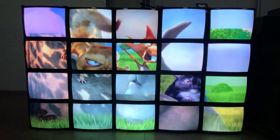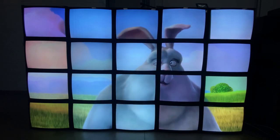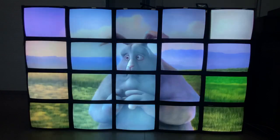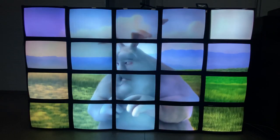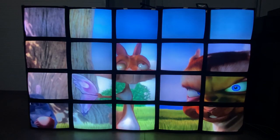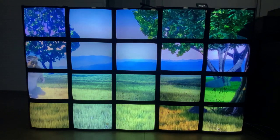Those two screens in particular are really standing out to me, which is slightly annoying, but there you go. We set this up just to test the screens were okay before they went out on a job — we didn't do any proper setup on them. Back in the day you would have taken a standard definition video signal and divided that across the five-by-four screens, so each screen was doing very low resolution. What I'm doing here is taking a 4K video and splitting it up across those screens, so each screen is actually still running at its full capability of 720 by 576 pixels. You're kind of watching nearly a 4K video on old analog standard-definition screens, which is something you can do now that you couldn't do back in the day — and it just looks so much better.